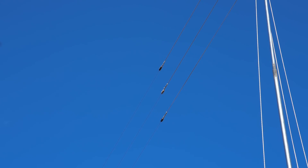I call this my 369 antenna. This is going to be using the third harmonic principle, so it'll be operating at one and a half wavelengths. That gives me a sweep of the entire HF band really nicely — lots of peaks and valleys, but it'll allow me to tune it quite nicely. I've also tried this with an HF receiver that I'd classify as very average, and if it makes that average receiver receive very well, it's a good antenna. Let me tell you, that average receiver is acting like a high-performance receiver. This antenna is working very, very well.